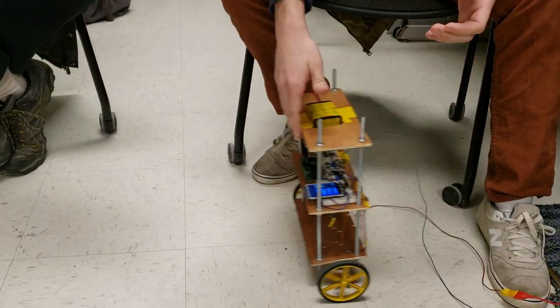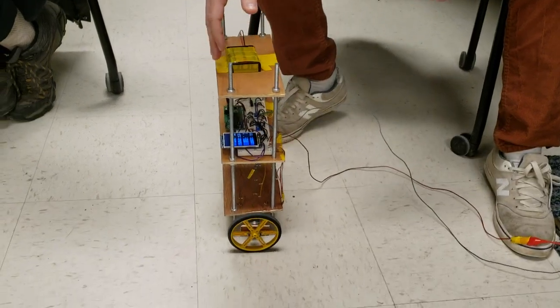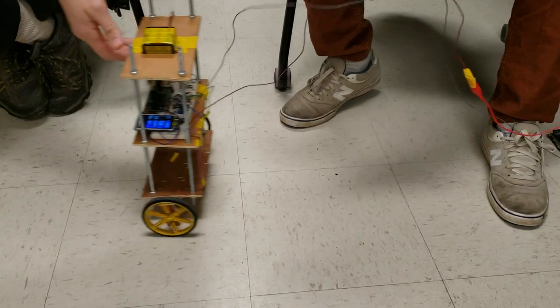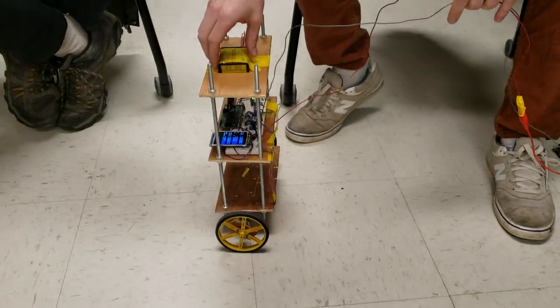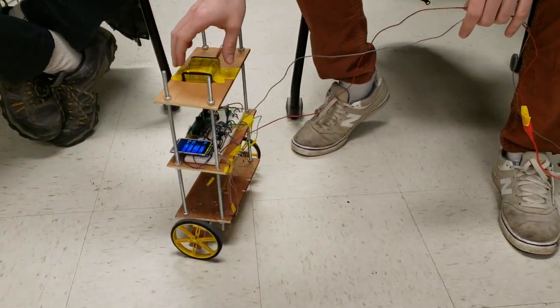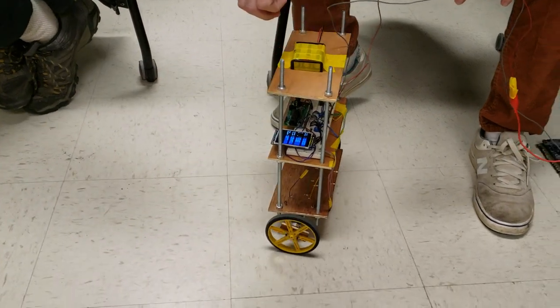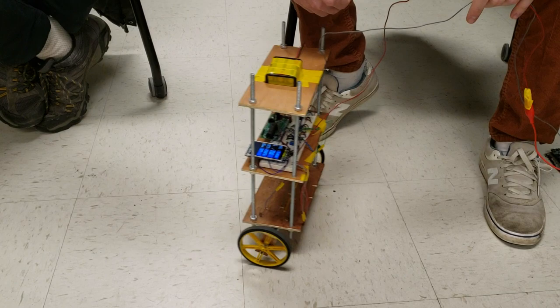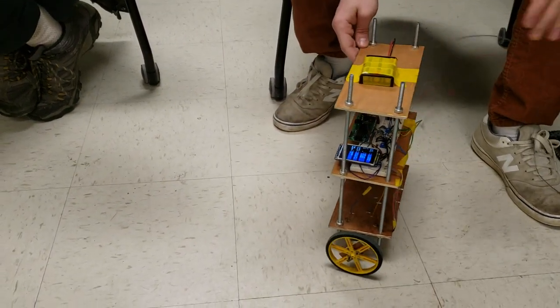We've played a lot with the height and weight distribution of the robot. We spent a lot of time trying to shave off as much weight as possible. Decreasing the mass is always helpful, but as we make the robot shorter, even though the amount of torque we needed to generate from the motors would decrease, the shorter robot falls faster. And so we need to be able to generate a faster rotation from the motors. So we ran into another wall there.